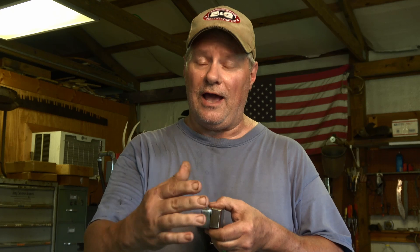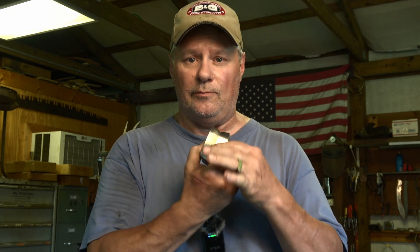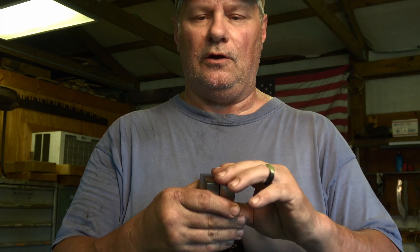What you saw me do right there - I took the two halves, cut them off the handle, split them, made sure they were split, and then put them back in the forge and flattened them out a little bit because I want the mating surfaces to be flat. Then I take it over to the belt grinder and clean them up all the way around, and then over to the disc sander and flatten them. I inspect the two halves to make sure there are no cracks, no delaminations, or anything in there because when you hot split them that's going to put a tremendous amount of stress on that billet. I'm going to put them together and weld the ends, not the sides - I'm not going to introduce anything on the sides because this is where the pattern is going to be.